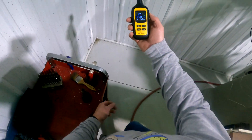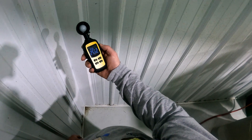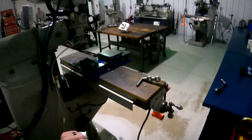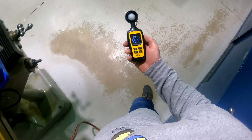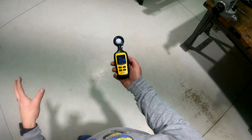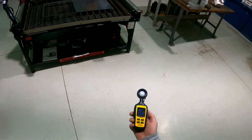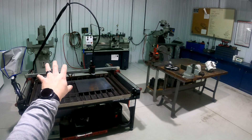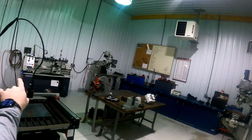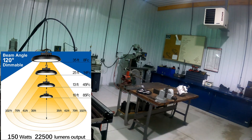Over in the corner where we were at 170 lux, we're still about 170 there because it gets shadowed by the overhead light structure — though we're a little higher, around 250 in spots. There's a shadow between the light and that area. But in general, this space is now at least twice as bright as before, and that's just replacing two lights. Looking across the building, even that far side is brighter because these LEDs project a fairly wide diameter at a 14-foot ceiling height.